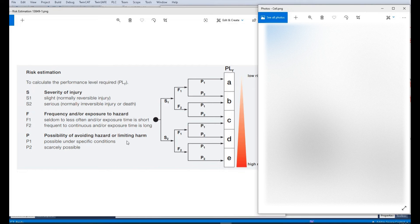For this cell, the safety evaluation will follow PLD Category 3. Let's do a rough evaluation for this machine. Since the machine has clamps and a weld tooling system inside, it could potentially cause serious injury to operators, so we follow the S2 path. For the exposure frequency, the operator outside is exposed frequently, so we select F2 — frequent to continuous with long exposure time.